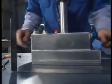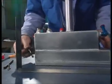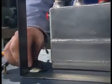Looks good enough to me. Glad to say nobody got whomped. There you have it — a right angle bend. Lovely. To mark up where the next bend is going to be, you need to get some of the rubber strip that's going to run on the inside of this bracket. Get two thicknesses of it and put that just against the edge of my first bend, like so. Slot in the heat exchanger, and then I'll know exactly where to bend the other end, just by marking along the edge of the sump. I'll square that off. Couple more bends, then I can spray it all up, stick on the rubber, and put the whole lot into the aircraft.